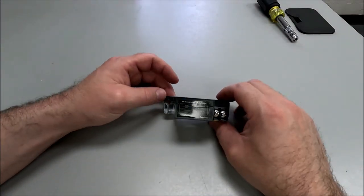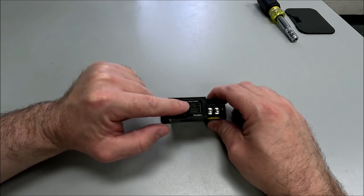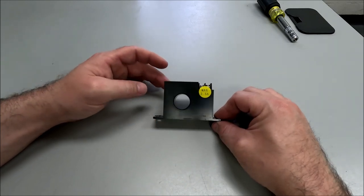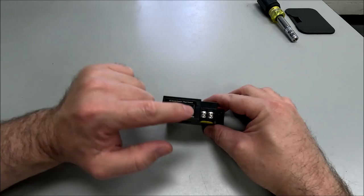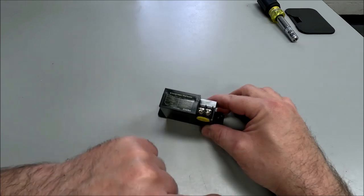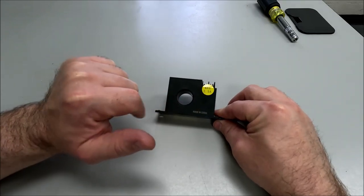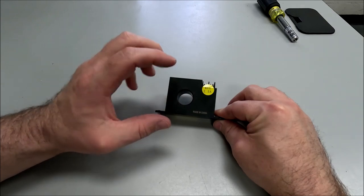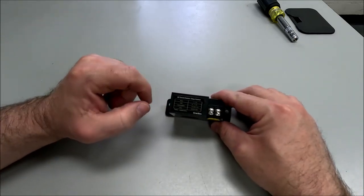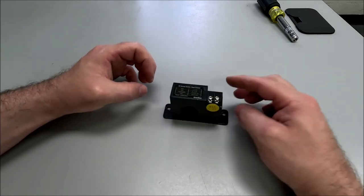This is a little part I picked up off Amazon. The manufacturer is Croxy and the model number is CS-TS0. They market it as a miniature current switch with a normally open switch. It's just one switch, so whatever you're trying to control — incoming circuit in, and if the switch closes the other side goes out. This hole right here is where we'll run our wire to sense current on, and bolt it down.